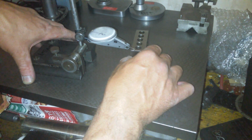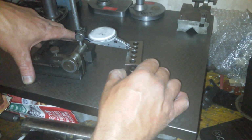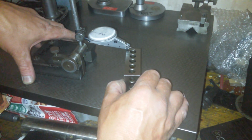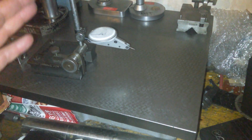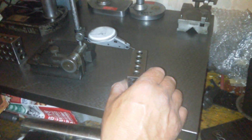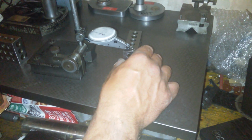So we've got minus 3 thou everywhere. And I've just bugged it up. I came off. Try and concentrate, lad. Minus 3 thou. Again, that's perfect. Okay, so that's pretty goddamn good. So parallel to each other, they're doing pretty well, to be fair. The other one, yep, same width to within 1/10, and that could be just my measuring skill.